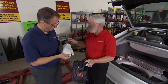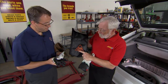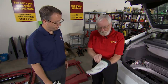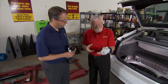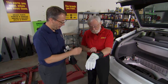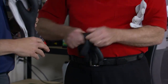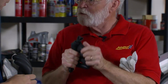We also have a magnetic-backed warning bag that reads 'Warning: Hybrid Vehicle in Service,' which we stick on the fender so people know we're working on a hybrid vehicle. Before using the gloves, you need to do an inflation test. You can visually identify obvious nicks and cuts, but you can't see pinhole leaks. Roll the glove up, put pressure on it, and listen for any pinholes — like listening for a balloon leaking.